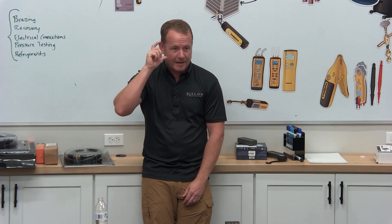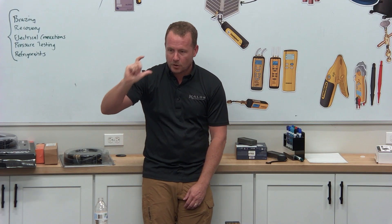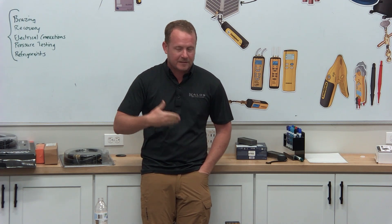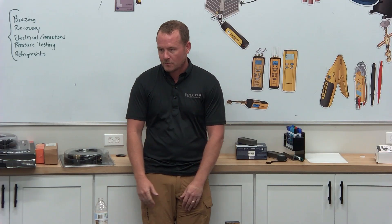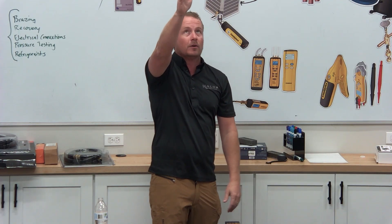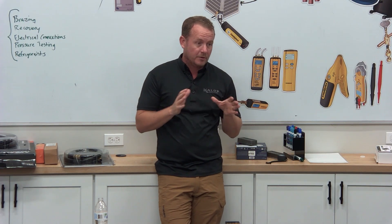If you close the curtain, then you'll be reading the curtain — because the curtain's not reflecting. It's whatever physical surface you're looking at. The thing that you can perfectly measure with a thermal imaging camera is something with an emissivity of one — meaning it's a perfectly non-reflecting surface. The only thing a thermal imaging camera measures perfectly is something that doesn't reflect any light. As you get more reflective, it becomes more challenging. The same thing is true with infrared guns — as you stand further away, you're measuring a broader average, not just the dot.